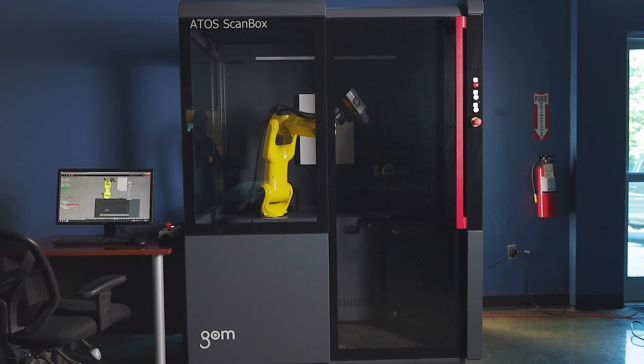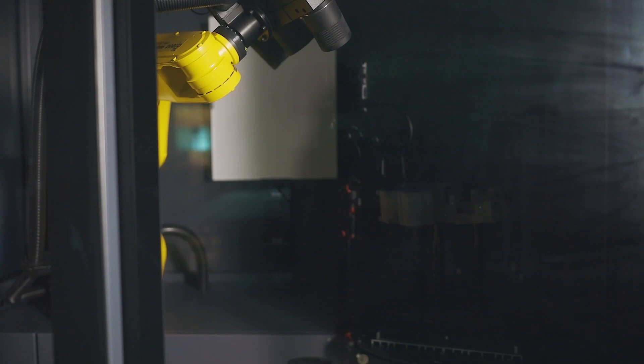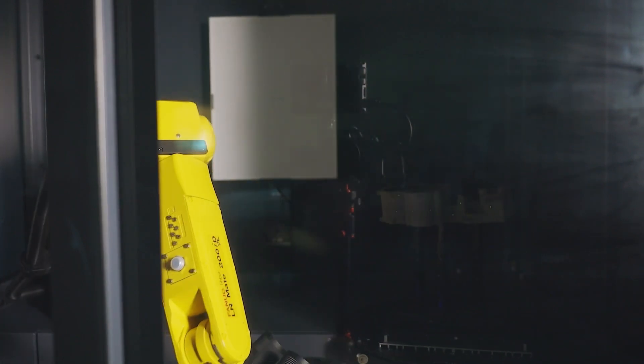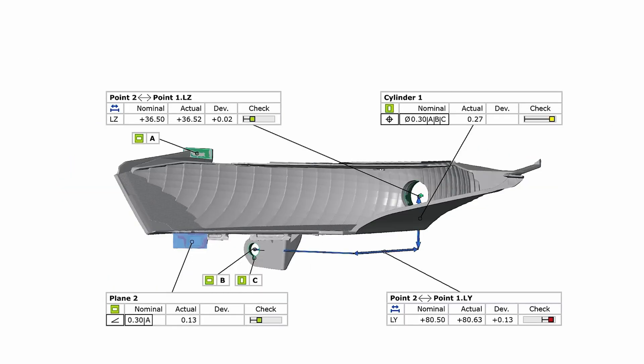The physical measuring times were reduced and they took advantage of 3D data visualizations and color maps that made communication and collaboration clearer and more efficient. In addition to adding more ATOS scanners and 2 Series 4 scan boxes, a big key to their success was designing innovative fixtures that allowed them to scan up to 16 separate parts at once. And with some basic Python scripting, they could complete scanning and inspection of all 16 parts in just a few minutes.